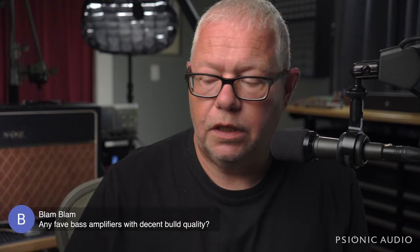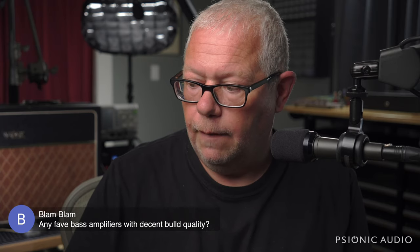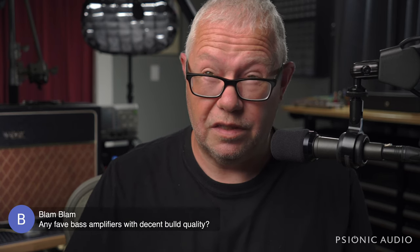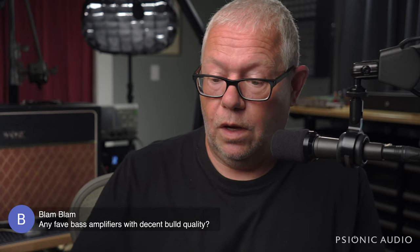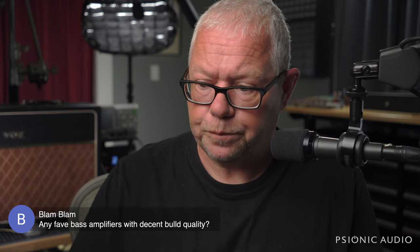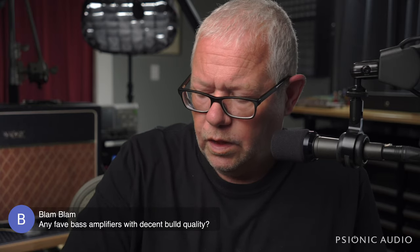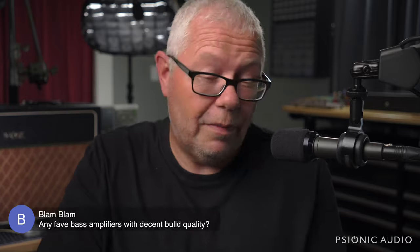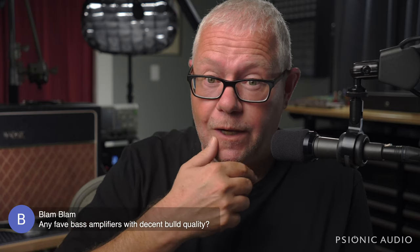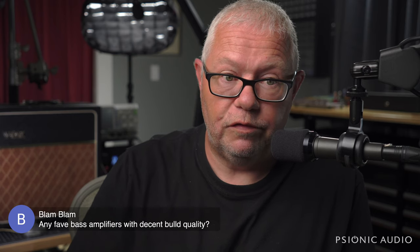Bass amplifiers are tricky, and I don't know what your price range is. If I were looking to make a bass rig to play out with, I would have two options in mind: either a Sansamp PSA-1 and maybe a 1,000-watt power amp in a four-rack unit head, with maybe a power strip or a tuner, and then running into whatever cabinets I had. Or I might look at just getting the Aguilar 500-watt little thing because they sound really good. And from what I can tell, their Class D implementation is a step up from other manufacturers.